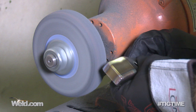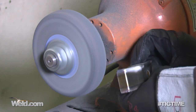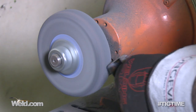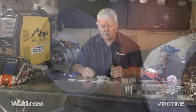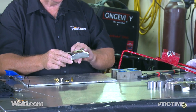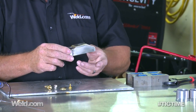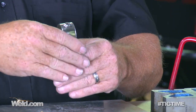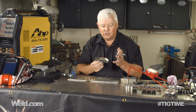What I did was what's called a rough polish. I have a polishing wheel back there — really a deburring wheel — about a medium or 80 grit deburring wheel. You can see it takes off the discoloration, I took some of the weld off, kind of rounded off the corners, got rid of any sharp edges. I rounded the top surface off, so I've got the shell ready for assembly.